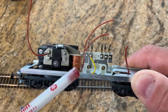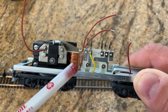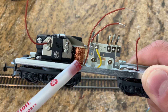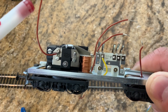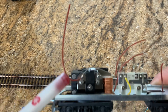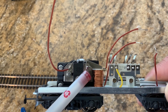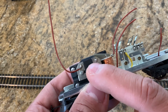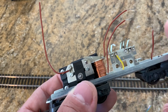Our magnet right here is what we need to convert into a permanent, or one-way, magnet. We do that by wiring our bridge rectifier into these two wires here, which will make sure the flow is in one direction. After we do that, we're going to connect either the gray or the orange onto one of the motor terminals. You'll notice there's a small diode and a lead coming off the winding for the electromagnet going to this terminal — we can just get rid of all that. That's what I've done here, and now we're going to solder a wire onto this terminal. We'll just insulate the old lead and call it a day.